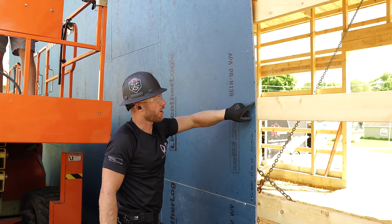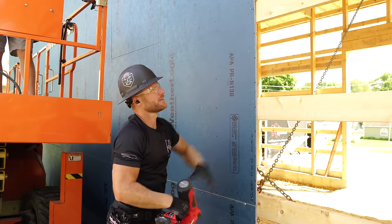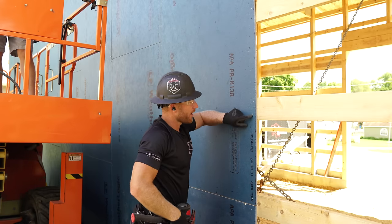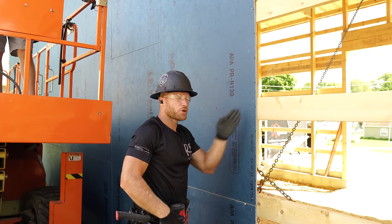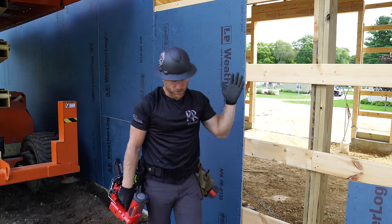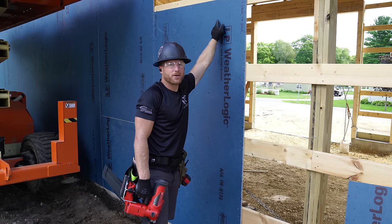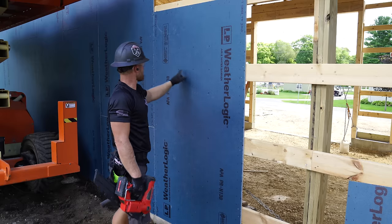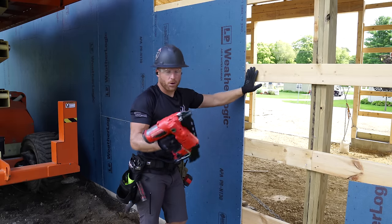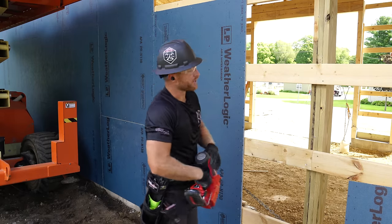Make sure that when you're nailing you stay three-eighths of an inch at least off of your edge. With this two-by-six wall girt, we're actually able to get two nails every 24 inches. If you have an issue where a nail isn't driven enough, make sure you drive it flush. If you end up with an over-driven nail too far into your substrate, make sure you tape those nails off. We're going to come back through and do the proper nailing pattern — a six-inch nail pattern around the perimeter and 12 inches through the field. We'll do that with a compressor and a coil gun.